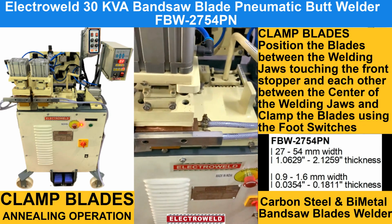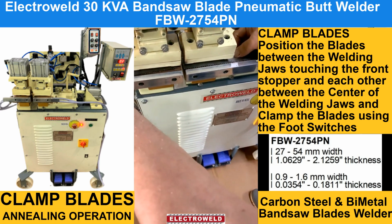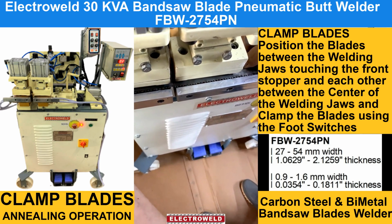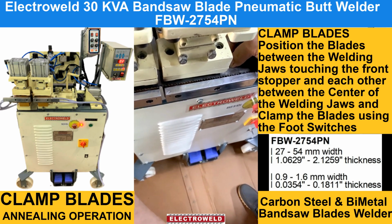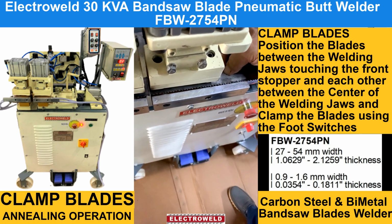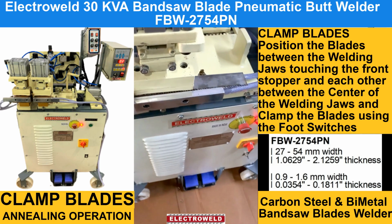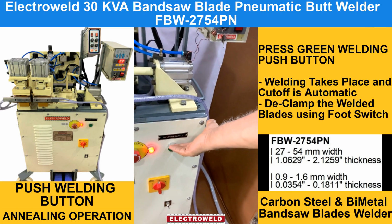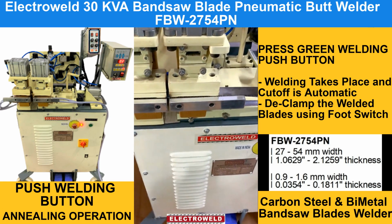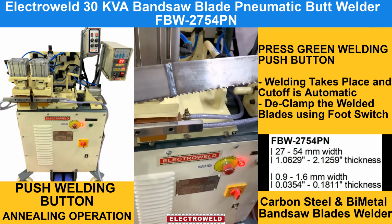Then you can clamp the blades like this, touching the front stopper. See that the blade is in the center of the welding jaws. Like this. Then clamp the blade. Then you can press this switch for welding. You will see welding taking place. This is how it's welded. Now you can declamp the blade. How it's welded.